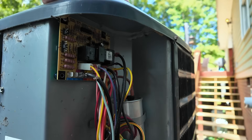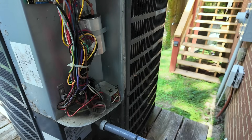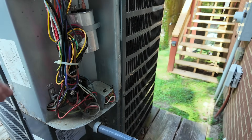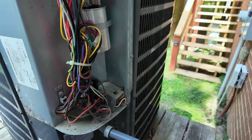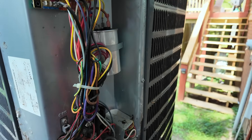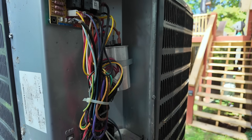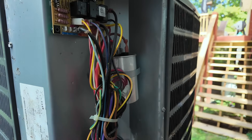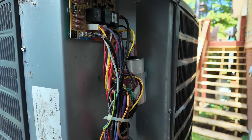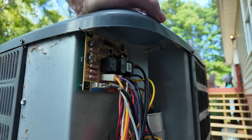It would be either on or off. As far as internal components, it's pretty basic. We've got our wiring coming in, a contactor down here that is basically just a switch — it's got a solenoid that pulls in, and when it closes it sends voltage through to turn the system on. We've got a capacitor up here, and our compressor and motor are both single-phase, so that capacitor needs to be in there to get the system going.